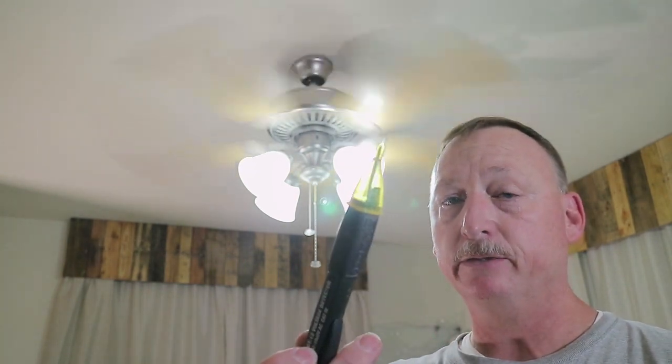Okay y'all. This is Fox Cooper at LivingCooper.com, with a couple simple how-to's. How to replace a ceiling fan chain pull switch with a light fixture. I hope this helps you guys out. It's pretty simple, right? All you need are some wire cutters, screwdriver, wire strippers and crimpers - which could be the same as your cutters - and maybe even a little voltage detector so you can make sure the voltage is off. It's not too difficult. And of course, a replacement light switch.